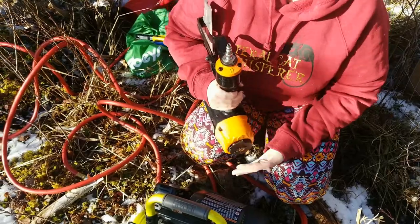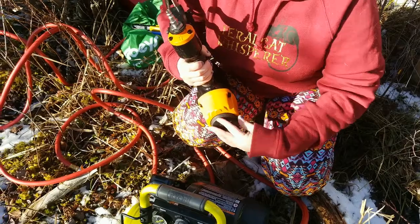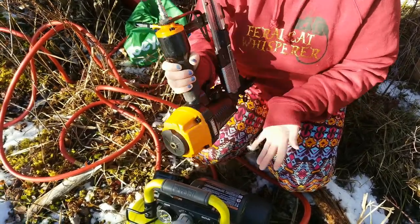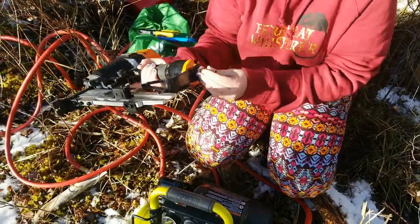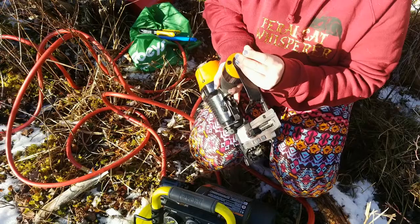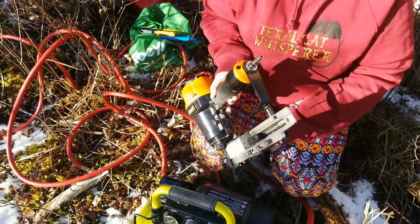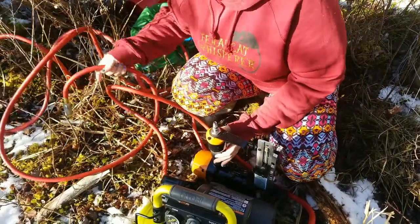And then there's also the exhaust. So this is where the air is going to come out when you engage the gun, and you can actually turn this depending on how you're utilizing the gun, so you don't get a blast of air in the face. Always good. So this is my gun here. This is your connection piece here. Again, it just comes like this, and then you have to buy the connector to be able to connect your rigid line. So I'm just gonna connect here.